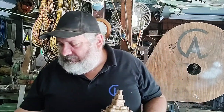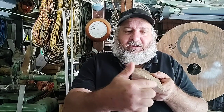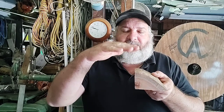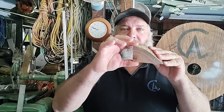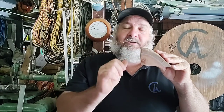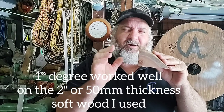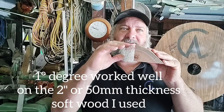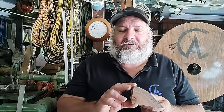Yeah, there's a few things I neglected or forgot to tell during the video. The flatter you make your board here, if you get a log with a flat section here, that will give you more of a flatter top on your castle. So just bear that in mind. The depth of your board, if you set it at 1 degree for a very narrow board, the chances of you pushing it straight through are higher. So you might have to set your angle greater. So do some test pieces. Get a piece of timber, test it out, and see how you go with it first before you go and cut it. That would be the best thing to do there.